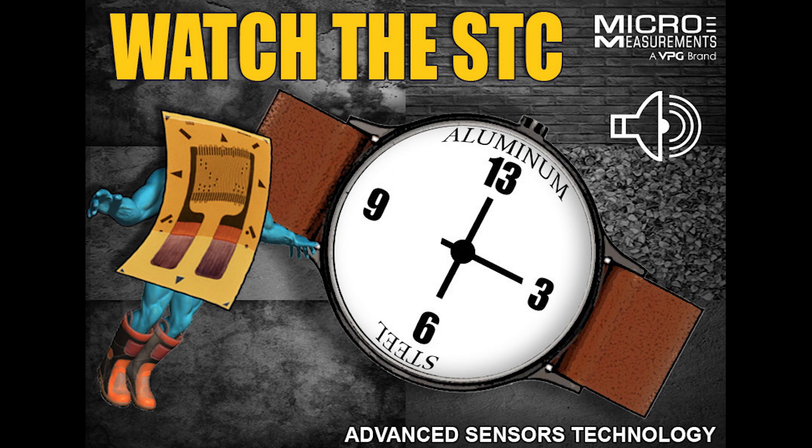What is his carbon fiber? Some carbon fiber, in line with the carbon fiber itself, it might be close to zero. Yeah, in this case we discussed that and the carbon fiber composite has a really low coefficient of thermal expansion, so I was leaning him towards using a 00 STC value. Now in some occasions a 03 might be slightly better if they've got a lot of matrix material — a lot of the epoxies — that might tend to make it expand a little bit more than it normally would.